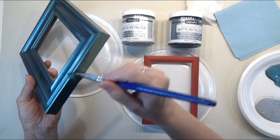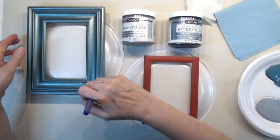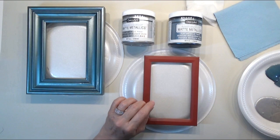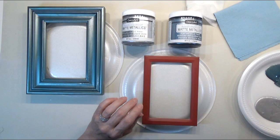If you're painting a bigger project, even a small project like this, you want to let each coat dry. Then you may need to lightly sand in between your coats — very lightly. And then let it harden, especially furniture — you want to let it harden one to two weeks before you actually use it. And it is an indoor-outdoor product.